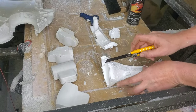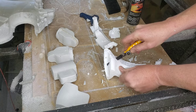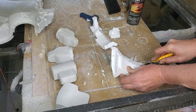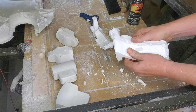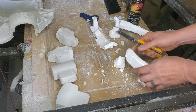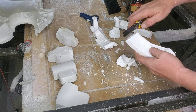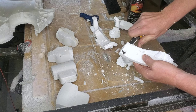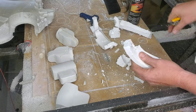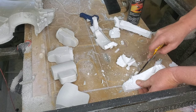Now I'm going to grab some polystyrene and cut it out. This came from packing material of a KitchenAid mixer — the type that has little beads in it. The reason why we're not using polystyrene in the original casting is you can't get as fine a detail. However, the less dense polystyrene makes really good sprues. Sprues are the end shoot where you pour your aluminum and it goes into the actual part. Because of the low density it doesn't take a lot of heat away from the original casting and it allows the aluminum to get in there a lot faster.